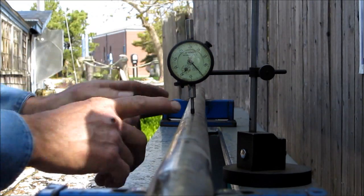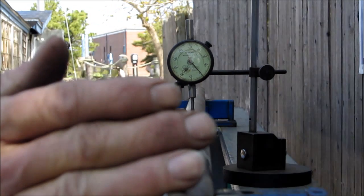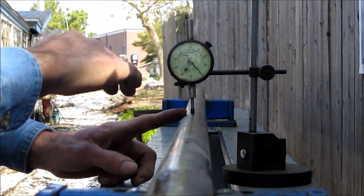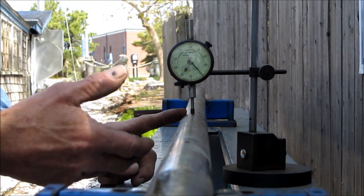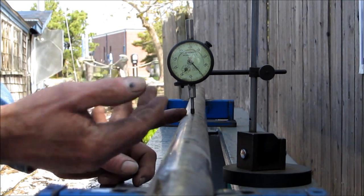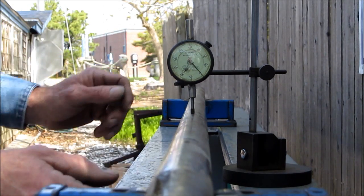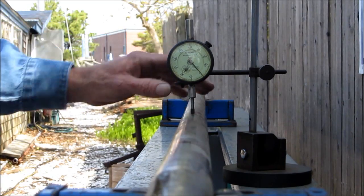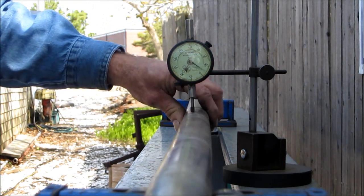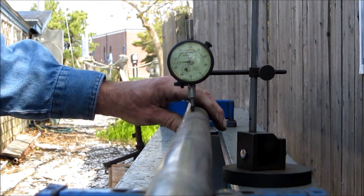Here's a look at the runout in this section. When you bend a wheel from force on the propeller, you cause a counter bend in the middle of the shaft. Or if the bottom came up and smacked your shaft in between a forward strut or a through-hull and a rear bearing, you can get bends like this. But if it bends here, it's got to bend somewhere else. We've got 210 thousandths there.